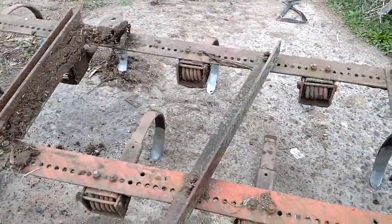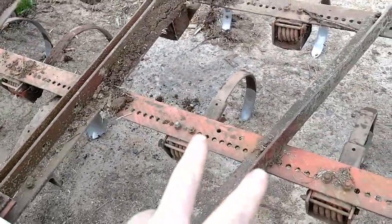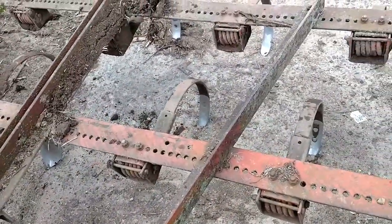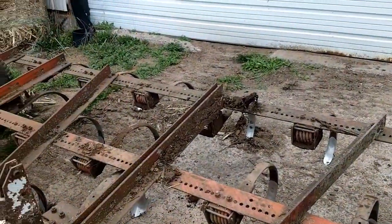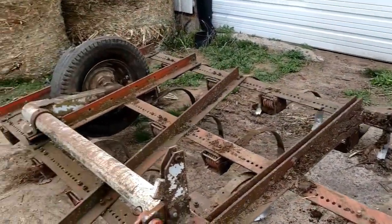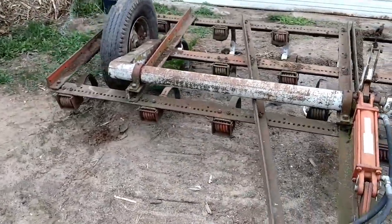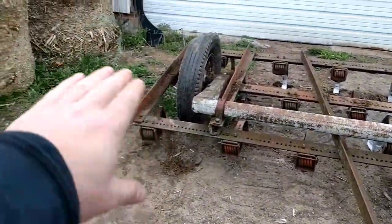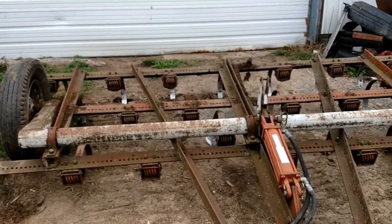I cut half of it off. But really, if a guy was going to use it, it really needs all new points. But I'd like to put the wider sweeps on it if I was going to keep it, because really the only thing I'd ever use it for is like what I'm doing right now, fixing messed up field from tillage before. I used to have an old Ford disc that left really bad ridges on the outside, and it was before I got my mulcher.